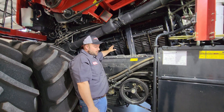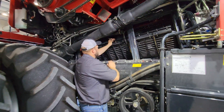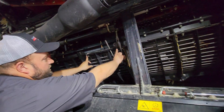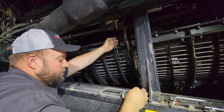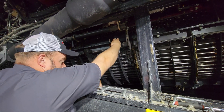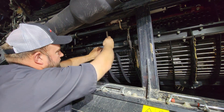We're going to start out with the concave modules in here. Some guys are a little afraid to take them out, but it's pretty easy — loosen these, take these two bolts loose, punch up in there, pull the bolts out. They get stuck and trash builds up in them, so they won't slide out this easy.